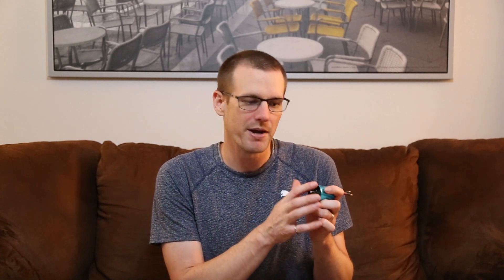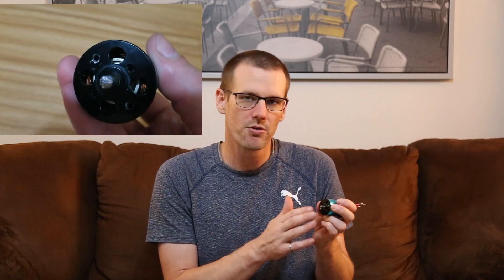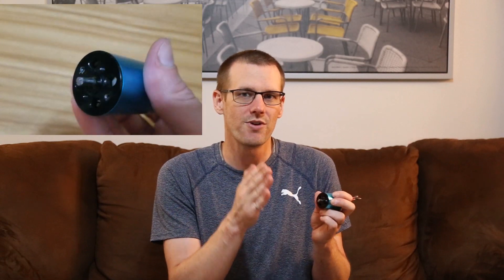The fourth and final brushless motor example does not have any sort of barrier between the copper windings and the front face. This is the type of motor where you can drive that fastener right through the front plate and into the copper windings, ultimately destroying it and making it a complete paperweight. That's what we want to avoid.